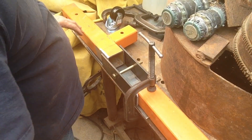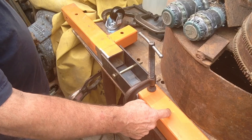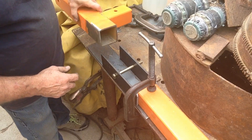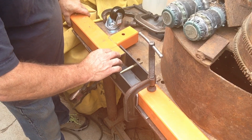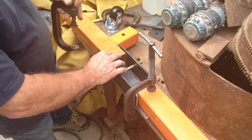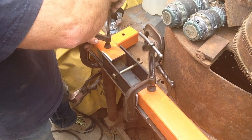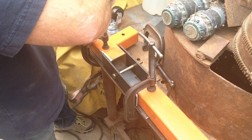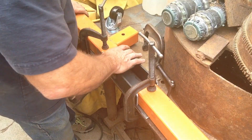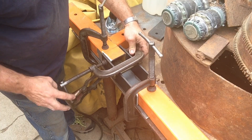Here's the setup — this is just the leg going out. This is the back end, this is where our crossbar goes, and this is where we're going to make our pivot. I've got this leg in here as a spacer in between, with a piece of flat bar underneath to hold everything at the same level. We've ground off the edges where we're going to weld this up, and we're placing the bracket where we want it and throwing a clamp around here. The spacing looks good for where we're going to mount this bracket.